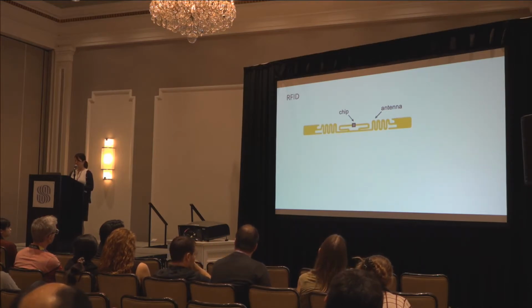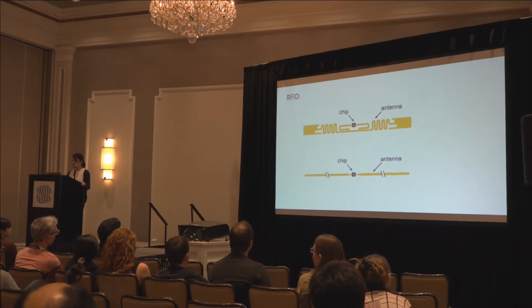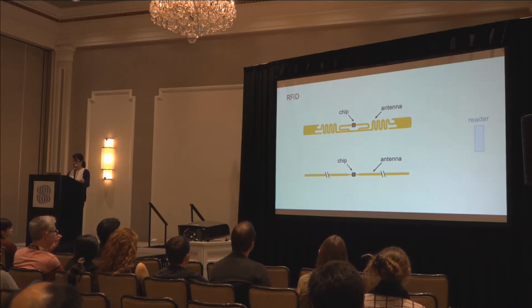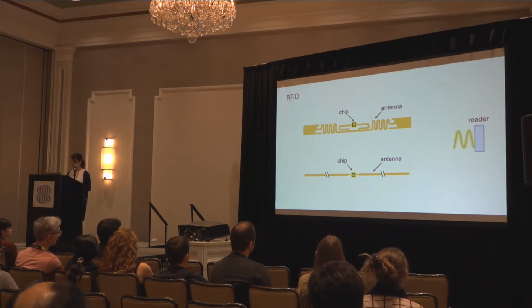As a battery-free sensing mechanism, we used RFID. A passive RFID tag is battery-free and consists of an antenna and chip. As long as the length of the antenna matches the wavelength, the antenna can be a very simple structure. For example, if just 2 straight wires are attached to the chip, they work as an antenna too. When the RFID tags are in the reader's detection range, the antenna receives the reader's radio wave and powers up the chip to respond with the unique ID to the reader.